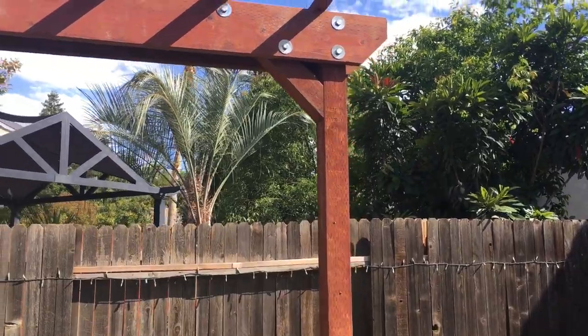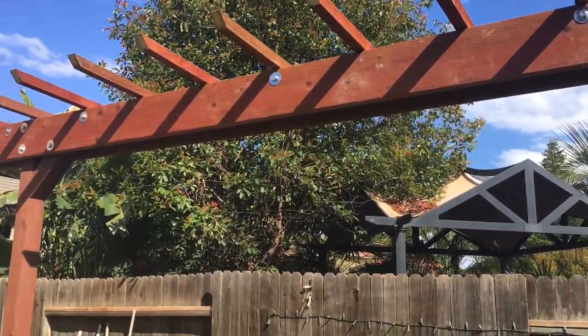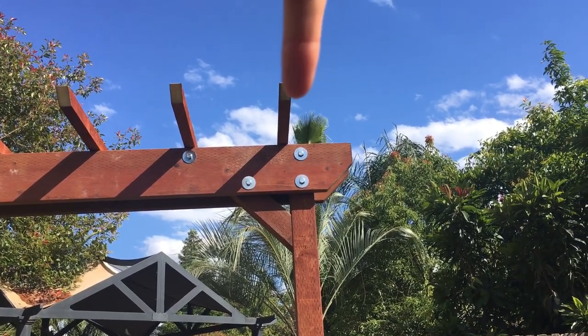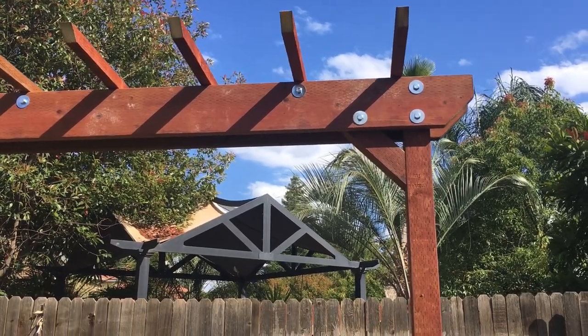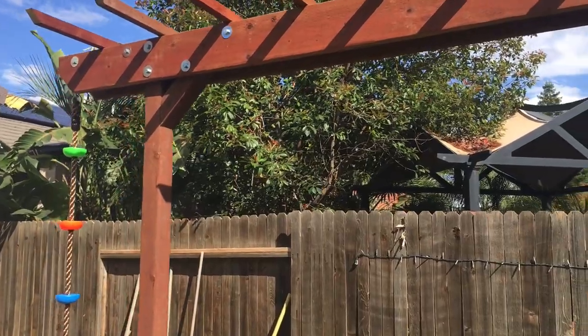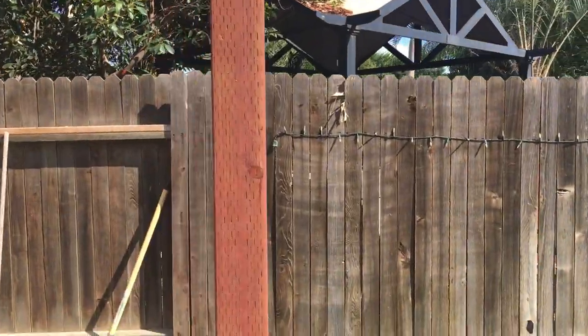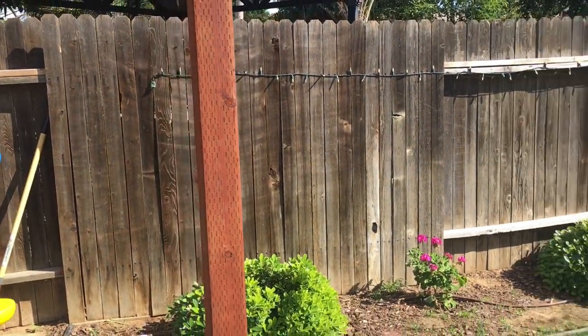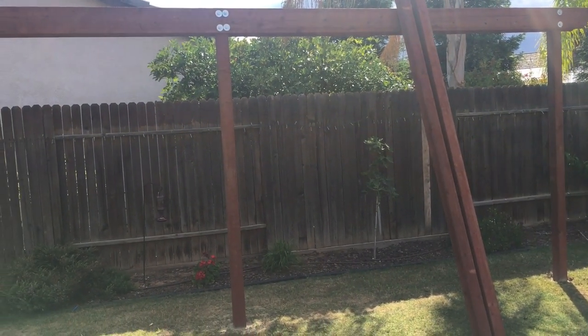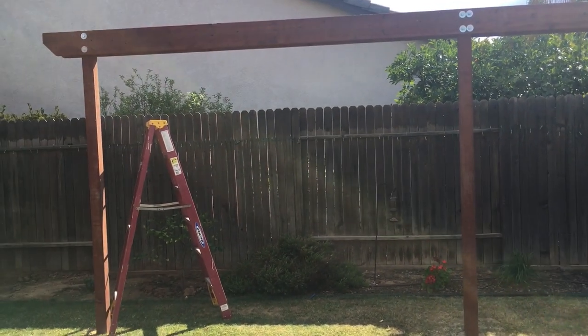Happy day three of our backyard project. We're coming up with a solution to keep the pergola from being wobbly. We're going to brace the insides of this pergola with these four-by-fours — extras we had — hanging from up there, braced with bolts and nails. We're also going to put two-by-sixes flanking both sides, making them real snug and tight. My husband went to go get the wood right now and we just got the hammock swings and the hammock delivered today, so we're super excited.